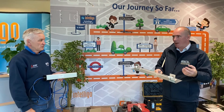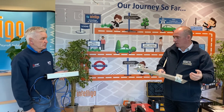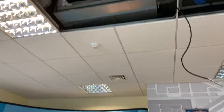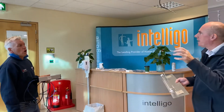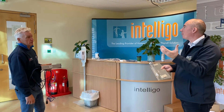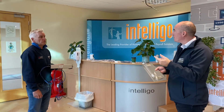HEPA filters of course are great for cleaning the air, but they block up and the efficiency of the fans can be reduced because the filter has to be replaced. Whereas this will last — it's actually cleaning the air. And if it's beside the coil, you're right beside the coil on this? Yeah, it's right in — just after the coil. So the other benefit of UVC is it actually kills bugs on the coil — it's a cold damp environment sometimes when it's on cooling mode, so consequently that'll keep it clean. That's going to improve the efficiency of your refrigeration system as well.